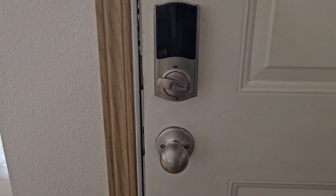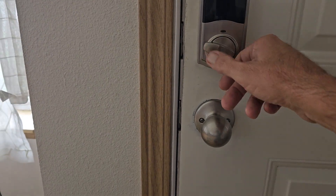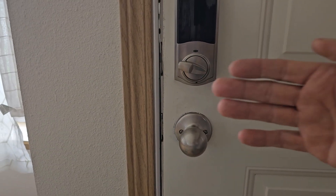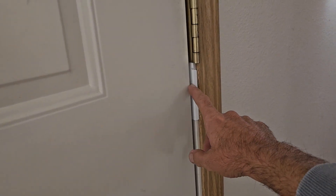I can live with it. I'm not going to cut this stuff off or make it beautiful — I'd rather have a small appearance issue than weaken the entire kit. I installed 17 of those three-and-a-half-inch screws total. I had to hand-fit everything carefully because with a keyless door and deadbolt, you can't have any drag whatsoever or it won't operate properly. Here's the back side of the hinge covers — the return flange wraps right around there nicely. Other than the fit and finish at the top, that's my only real complaint. Thanks for watching!